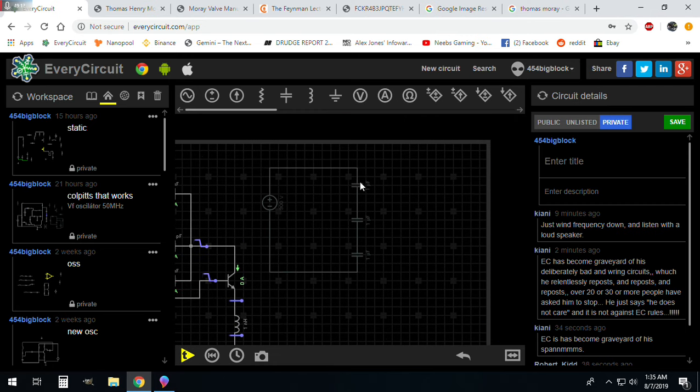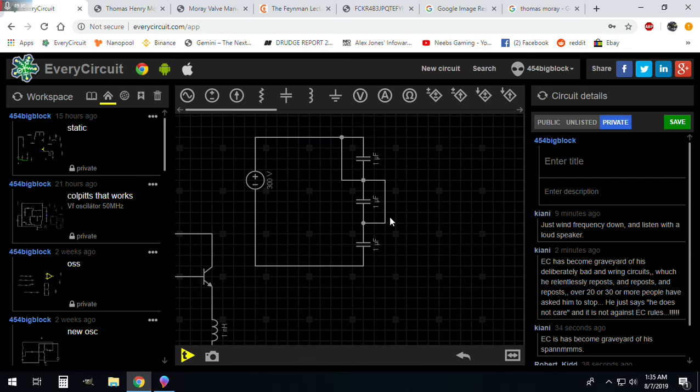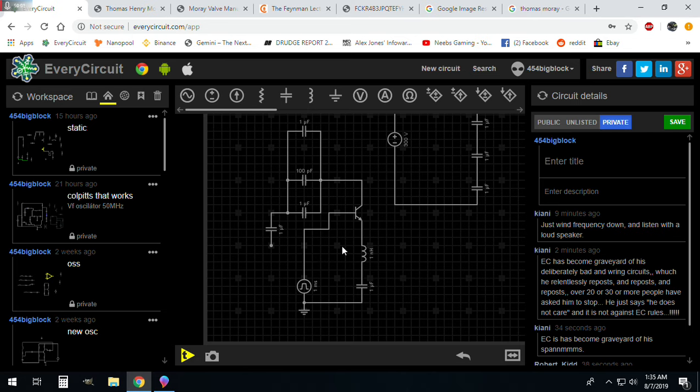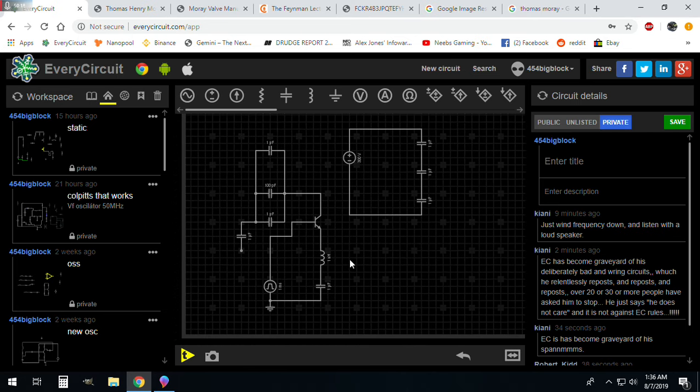Either way, you put capacitors like this, and if I was to test, here would be a third, here would be 2/3, and here would be the full voltage. So just putting the same value capacitors like that, you are dividing the voltage without putting a real resistance, a DC resistance, in the system. So that's your little trick. If you got your phase lock loop or your triggered thyristor to dump, and you're dealing with these high voltages and you don't know how to get your digital stuff to work with it without adding resistance that screws everything up, you gotta use capacitor voltage dividers.